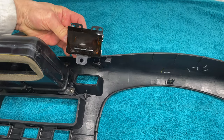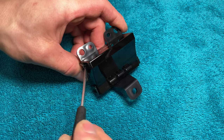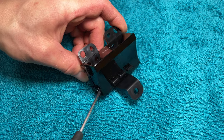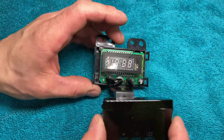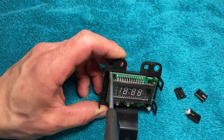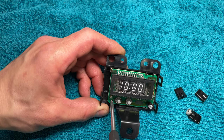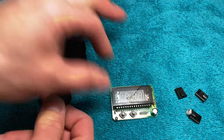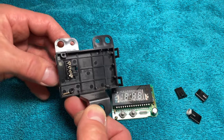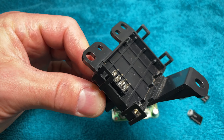The clock is held in by two screws. Use a small flathead screwdriver to gently pry the four tabs on the clock to open it up. The circuit board inside is held by two small Phillips head screws — just pull it straight up to remove it. Notice the four terminals have springs on them; they connect power to the circuit board.